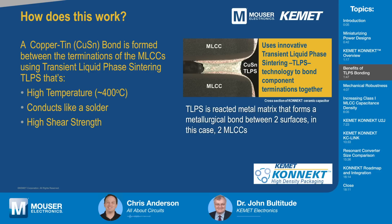So you're able to bond at a low temperature, but then get the high temperature properties in the finished product? Exactly. And the high temperature performance is very important because we want to mount these using a SAC reflow. We couldn't bond these with a SAC solder instead of the TLPS because it would simply remelt when we surface-mounted the component.